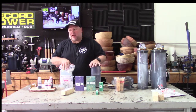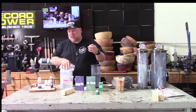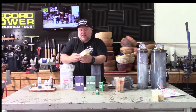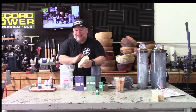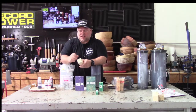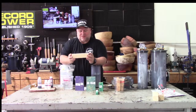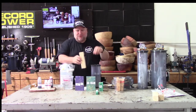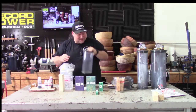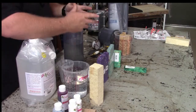Yeah, that'll definitely happen. That'll sometimes happen more if there's moisture in it, so you want to make sure it's really dry. Another thing, and I didn't mention this before, is that you want to make sure everything's really clean. You don't want dust on it or loose bark. Chip off any bark, clean it, sand it, brush it. Anything that's dirty on there, see how that looks dirty? You can see on the bottom there's a bunch of dust because I didn't clean these. It's all going to get in your resin and make it dirty or brown.